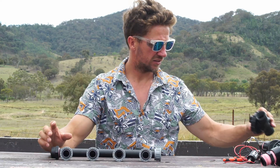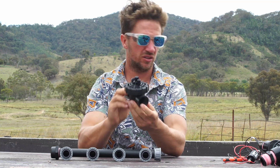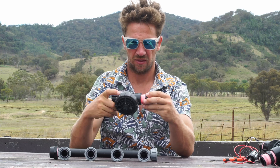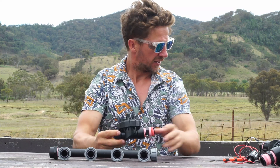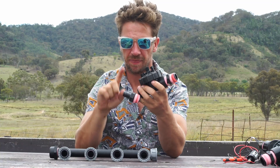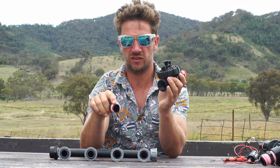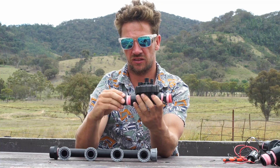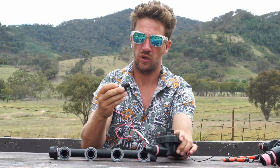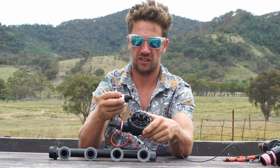These things just need to be hand tight. The next component is a diaphragm, one inch. I'll need a one-inch nipple — first I'm going to put it into the diaphragm on the inlet side. On the exit I've got 19mm hose or low-density sprinkling pipe, and on the other side I've got the one-inch BSP for this particular diaphragm, so I'm just screwing that in.